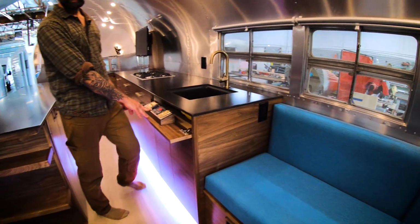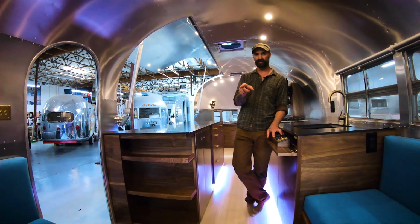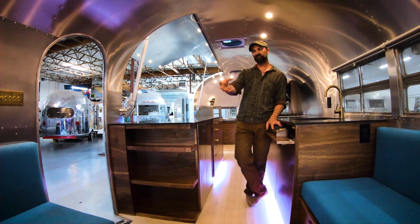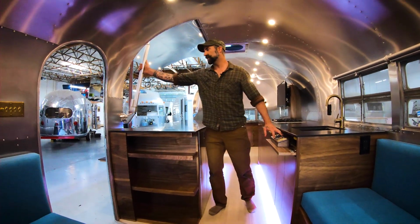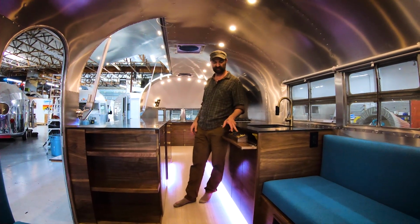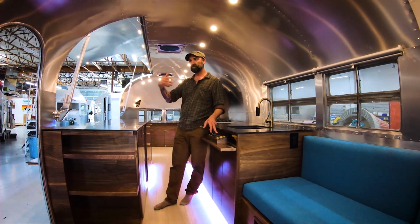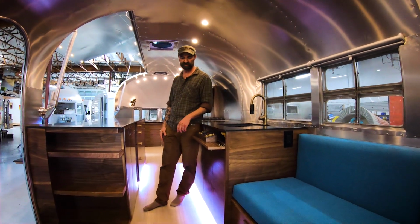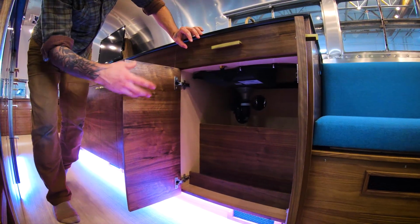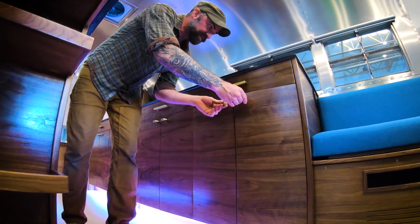The reason we have this is because we have an automatic battery kill switch in here that will kill the batteries at 11.9 volts, that way we don't destroy the battery. Because we have electronic actuator arms that pull the service window open, if everything dies, you can hit this override switch, still be able to close your service window or power some lights temporarily and have some extra juice without hurting the cells. This actually is a false wall that houses the water pump and accumulator, so you don't have to look at it, but you can access it super quick if there's any issues.